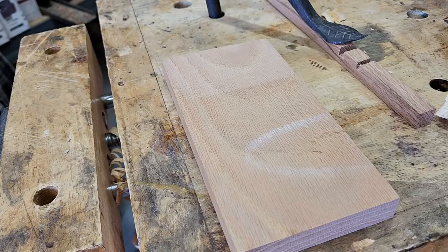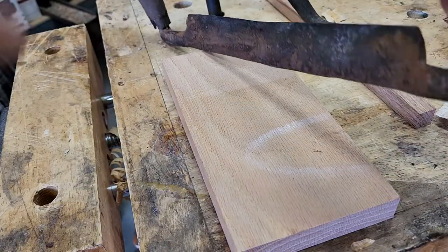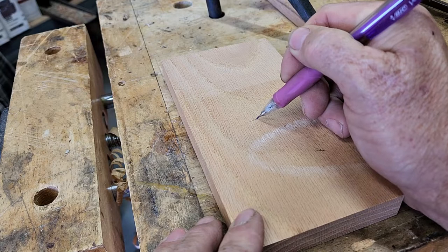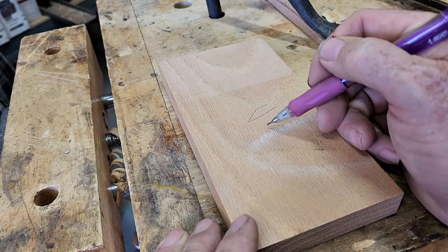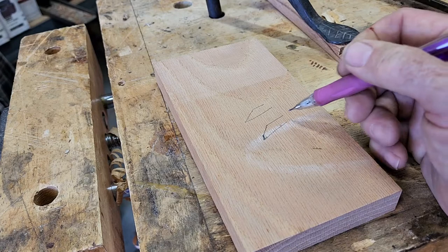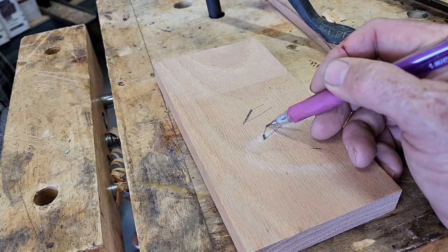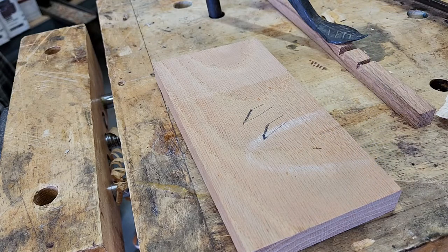Before we do a test cut, let's see what I did to it. I did what's called a secondary bevel. So the back of this is flat and the top of it's beveled. So the profile of the tool looks like this. It's flat and it's beveled, and then it goes to the rest of the tool, right? A secondary bevel looks like this. You have your bevel, and then you put a little bevel on the very end of it. So this becomes easier to sharpen. Every time you can just come and secondary it, and then every now and again you just have to reprofile this. So it's got a secondary bevel on there. It should stay sharp, should be easy to sharpen afterwards. The back is flat, so let's test it.